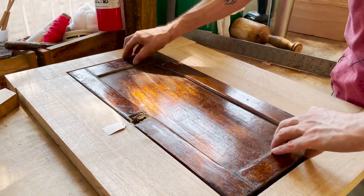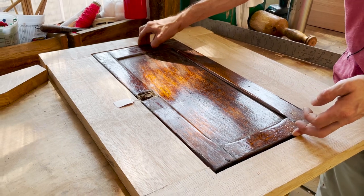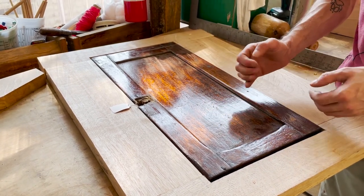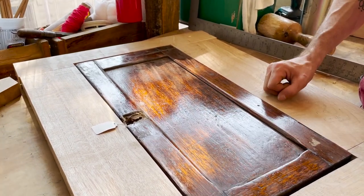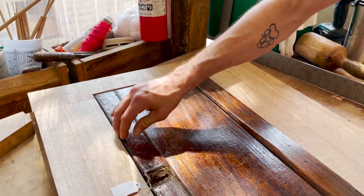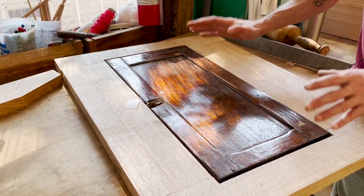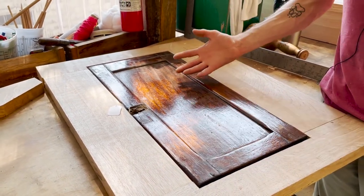The first is that there is a lot of slop in the fit of the door, and that is done on purpose. When we got Victoria, there were a lot of locker doors that were completely swollen shut, so you couldn't open them. Some of them have damage from where they've been yanked open. So we wanted to make sure that there was a significant amount of play, and I might even open this up just a little bit more so that the door has plenty of room. I would much, much rather the door have a bit of reveal around it than have the door get stuck.